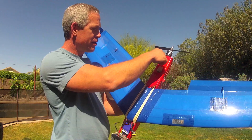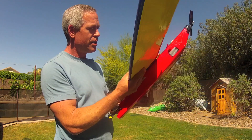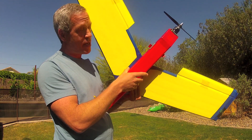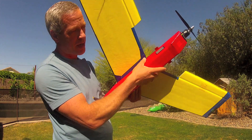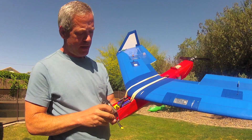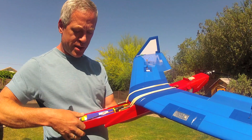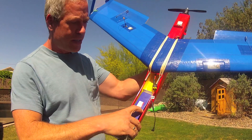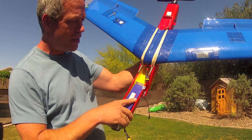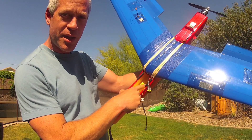So what I did was made the fuselage longer by 50%, so it's 20 inches long now, and consequently it's narrower as well. It makes it a little bit easier to grasp and hand launch, and provides a much larger space for me to adjust the battery location on the inside. You'll note that large empty space behind the battery which I can shift — that was previously occupied by a lot of the electronics.